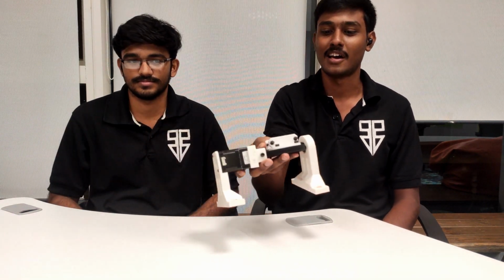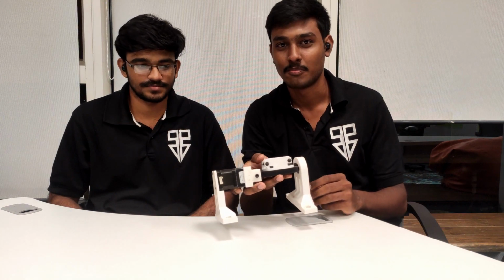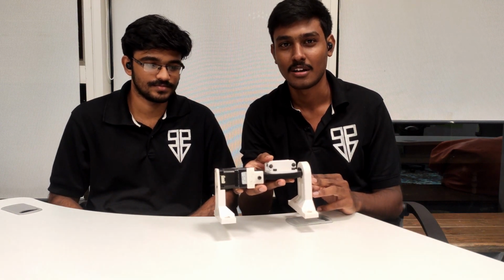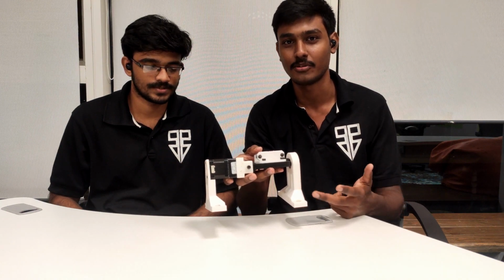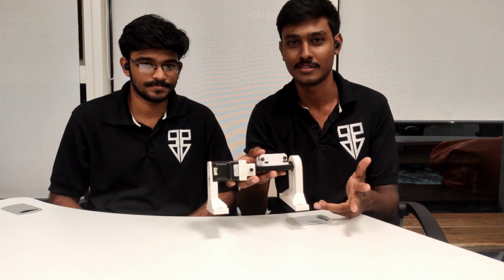Hey guys, what's up? It's been a long time since we did a long video, like previously 4 or 5 videos back, and we did a video on VMC, mini VMC, which we made ourselves. Now we are going to attach an extra additional part, which is actually the A-axis. The A-axis is something which is parallel to the X-axis, and there are two other axes, B and C, which are parallel to Y and Z correspondingly.